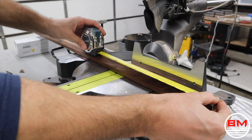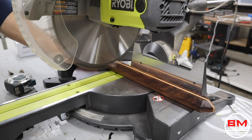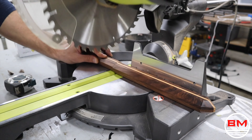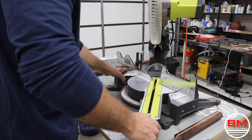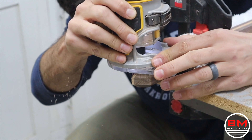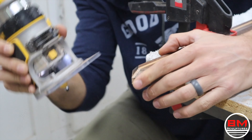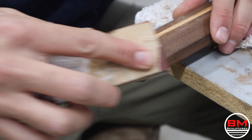I have a little bit of a problem — the handle is too long. I knew it was going to be long, but when I put it on the shovel head it just looks out of whack. So I'm going to have to cut off a full 11 inches of this handle, right in the absolute best part of the wood grain. I'm kicking myself for not building the entire handle around this grain. Don't worry, I am not scrapping it — I have a plan for this piece in the near future. Then of course I have to use my router to re-chamfer those edges at 45 degrees, re-sand, finish sand, and then refinish this entire end of the handle.